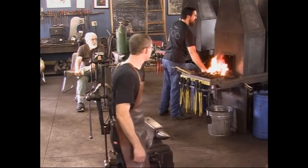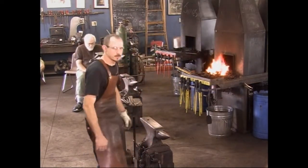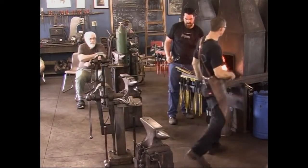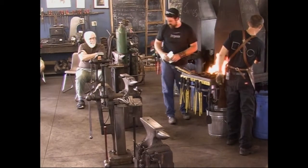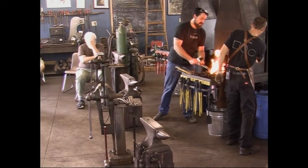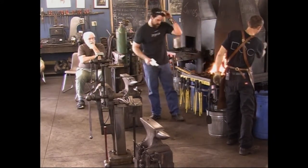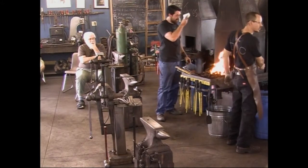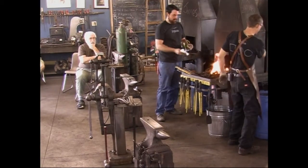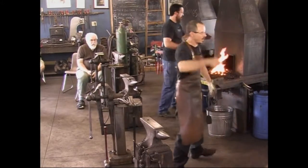With a lot of the power hammer tools I use, I do exactly that. I don't have the whiteboard up, but yeah, I'll draw here. With a lot of my power hammer tooling, say like a thin-bladed hack for cutting. You've got a thin blade hack. I weld a piece of flat bar on there, much wider, so that the power hammer die has a nice surface to contact here and keep that thing straight. It may have a slight crowning to it, a little, not much. Nice wide surface, both sides. Yes, that makes real good contact for the power hammer die.